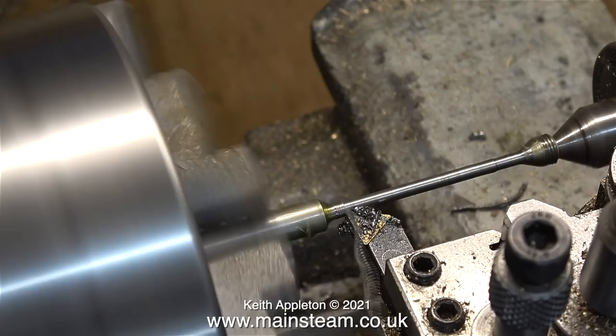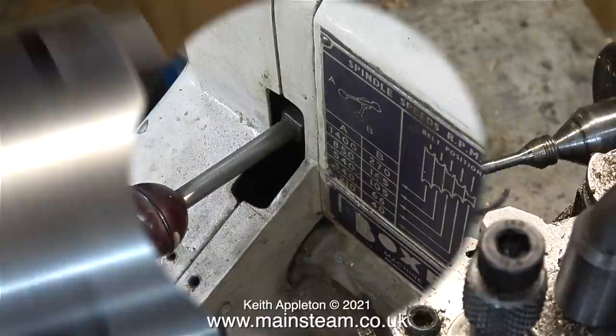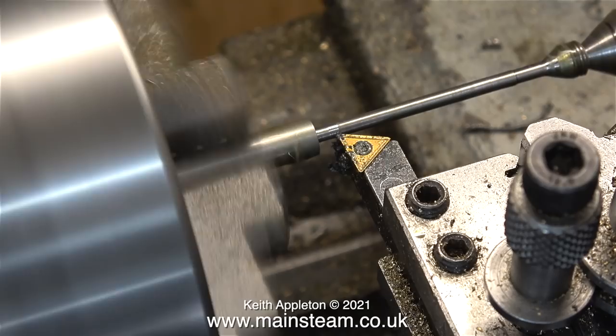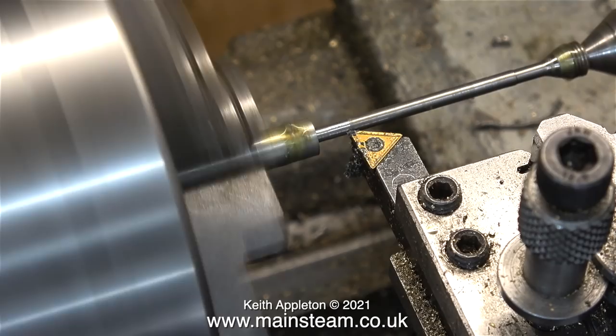Moving forward to the current job — you'll notice at the right hand side of the shaft the diameter is slightly less. This is my test cut area for my micrometer, and this lesser-diameter section will be cut off when I shorten the shaft to the length I need. Here I'm reversing the direction of the traverser by moving the gears, and now the cutting tool is moving from left to right. This is a good thing because the right hand side of the cutting tool is sharper and the metal is shinier.